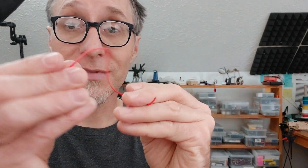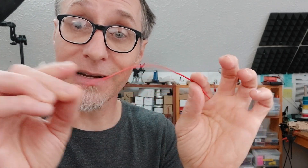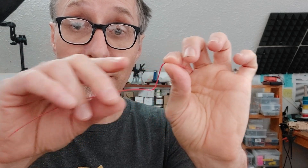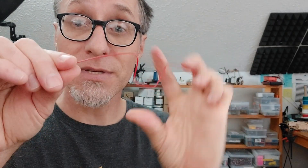In this video, I'm going to be talking about two different kinds of wire to make our connections. We have a flexible, soft, silicone wire for all movable connections — when I'm connecting up things like the knob, I'm going to use this. For the onboard connections, I'm going to use solid core wire which can be bent into shapes and will hold its shape. They're very different wire types, so use the correct type depending on what you're trying to do.